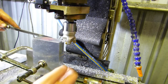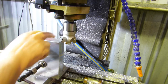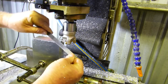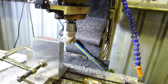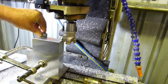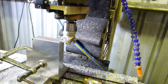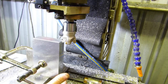Okay, it's another lovely finish. We'll just deburr again. That should be lovely and square. Not a sausage of light through there. I probably should be using a bigger one, but that's alright. I did take time to set it up. The bottom end here isn't touching properly because it wasn't quite square with the sides that we milled earlier.